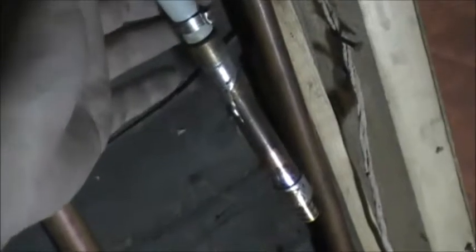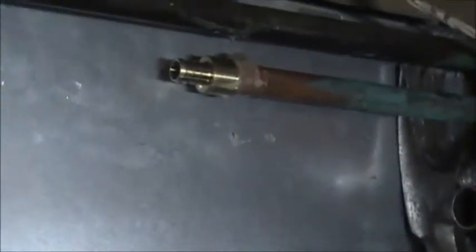I've jumped a little bit ahead here, but this is another old piece — this is what was left of the piece of pipe. As you can see, I already soldered one connector on there. So now I'm down in this corner and I've got to solder this one on to this pipe. I've got a piece of metal put behind her so I don't burn the wood. But I do have a pot of water ready to go just in case I've got to give her a douse. Let's get her cooking. Alright guys, she's soldered. It's tough to solder uphill, as you know, but she's on there now.